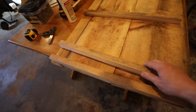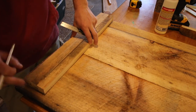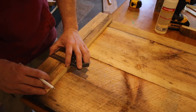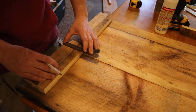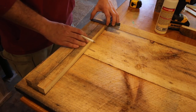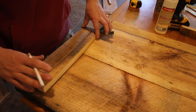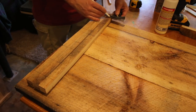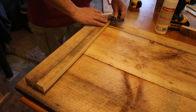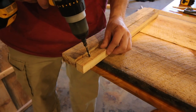Let's mark our layout for our screw holes and get those pre-drilled. I'm going to use my combination square, lay my three boards together, spacing them roughly an inch off the edge, then mark where we need to pre-drill. Three holes per board for the wide boards would be nice - we don't want to go too close to the edge. Being rough sawn lumber, everything is not square, which is fine - we want that rough look, so we need to realize it's not perfect nor do we want it to be. On the little edge pieces I want two holes. The nice thing about the new combo kit is I got a drill and an impact driver - I can use the drill to drill out my holes and keep the bit in the impact driver to screw these in place.